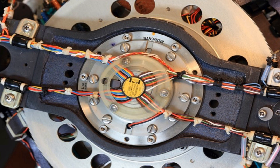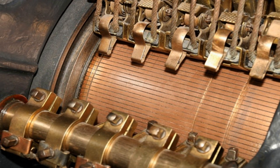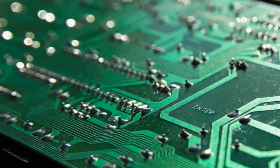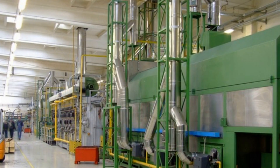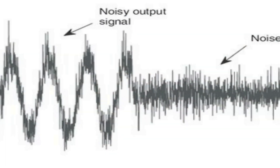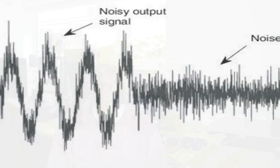There are slip rings attached to one component of the machine and a set of fine metal brushes connected to the other. The brushes remain in contact with the slip rings, providing an electrical path from one part to another while allowing them to rotate about each other. Nevertheless, there are problems with smaller devices because of this. Whereas in larger devices, minor fluctuations produced through the brush mechanisms are really insignificant, this is not the case for smaller electronic components. The brushes produce and introduce intolerable levels of noise to the stream of power supplied. Therefore, a more efficient means of delivering energy is required.